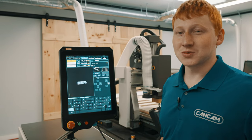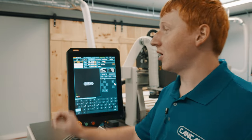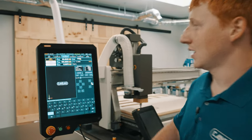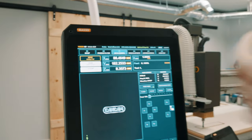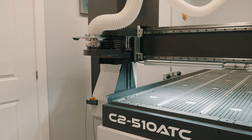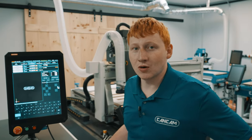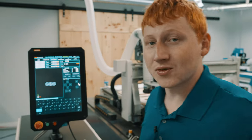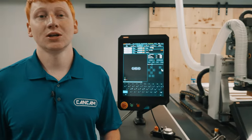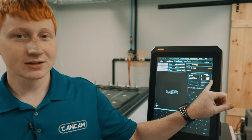This is the process in which the machine finds its starting position and allows it to locate all of the tool holders and stroke limitations of the machine. To do this, we're going to double tap the home icon up the top left of your screen. Once the machine is homed, you'll notice that it is in the front left-hand corner. This is commonly known as your machine coordinate home position, and you can see this identified at the right-hand side of your screen